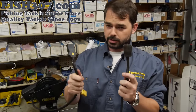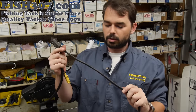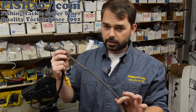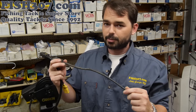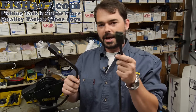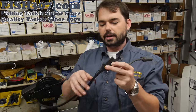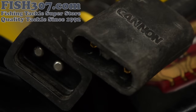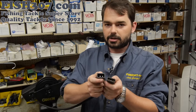What we have here is the new since-2007 Cannon power cord and the pre-2007 Cannon power cord. The problem with the old power cord is you used to get a lot of sun rot when you leave these out on your boat — the wire would be very prone to cracking, leaving exposed wires which cause shorts, poor performance, and actually poses a threat of electrocution to anyone on the boat. So we suggest switching over to the new heavier-duty Cannon style plug. It's a much thicker cord, it won't rot in the sun, it has a much better water-resistant plug, and it's going to give your downrigger better performance because electricity comes through more efficiently.